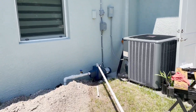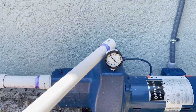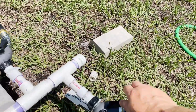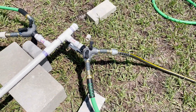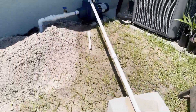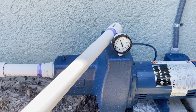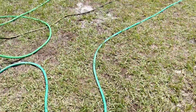It's a trade-off on cost. With six running right now I've got about 37 PSI. What I'm going to do is turn one of the sprinklers off and see what the increase in pressure is. Now I'm running five heads and it looks like I'm right there — 45, 44, 43 — so kind of in between.